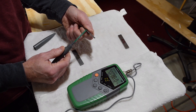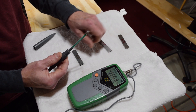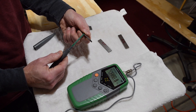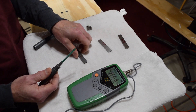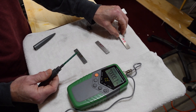As you move the probe around, you can see what your strongest Gauss readings are. Remember: the higher that number, the brighter the pickup will sound, and the lower the number, the warmer. When you look at an Alnico 8 magnet, the Gauss is starting to jump up around 1100 Gauss — substantially stronger. That's why an Alnico 8 sounds so much brighter in a pickup than an Alnico 5 or Alnico 2.